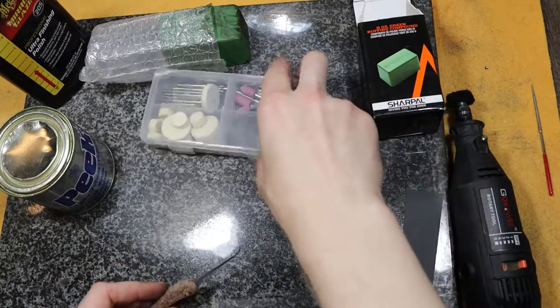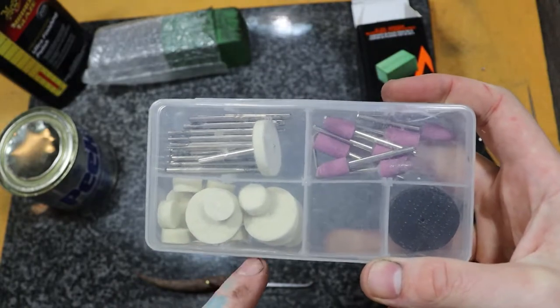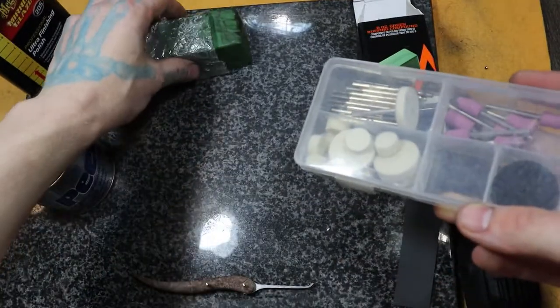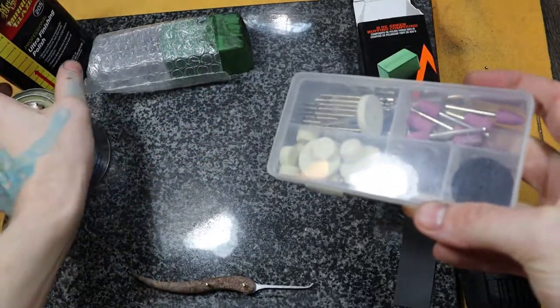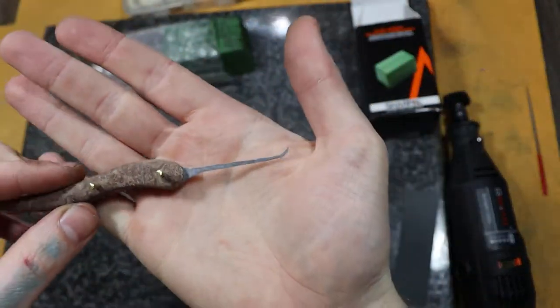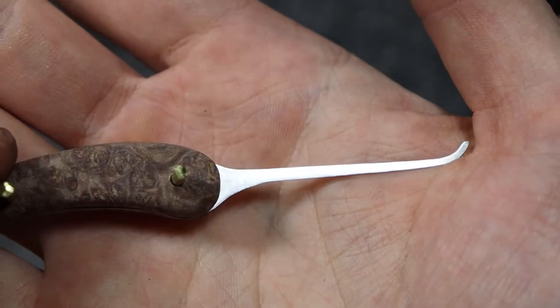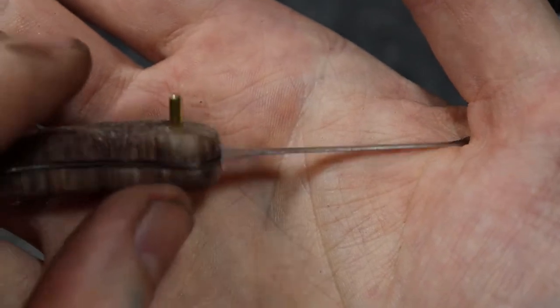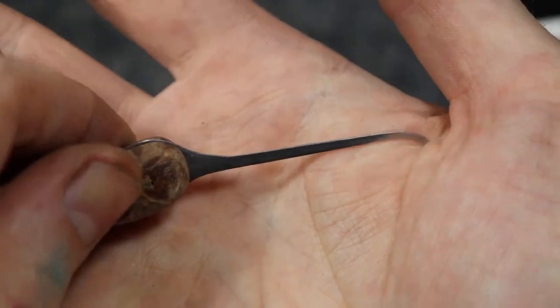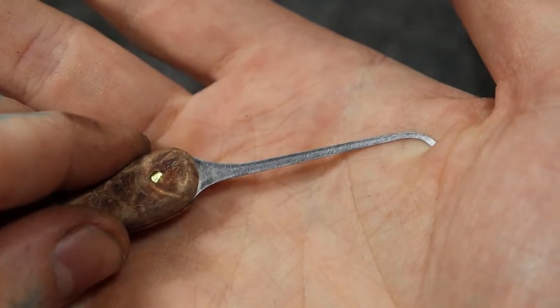And with the Dremel, we'll use these, I guess they're cotton, I don't remember what they are, these buffing brushes right here, along with this compound, and then we'll follow up with these two at the end. So, first though, let's see if we can get that in view there. If you look towards the inside part, you can see that there's just a little bit of a triangle sticking out, where it's not quite as buffed as the rest of it. You can kind of see it just a little bit right there. And we want to get rid of that before we buff it with our Dremel.